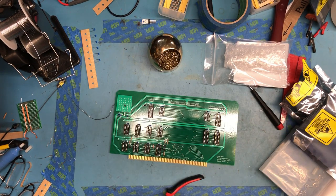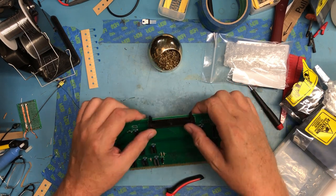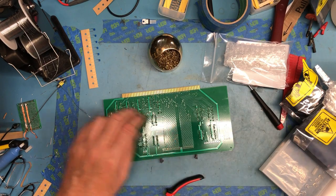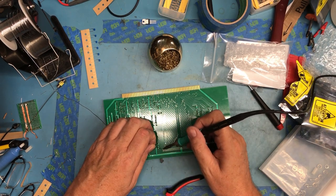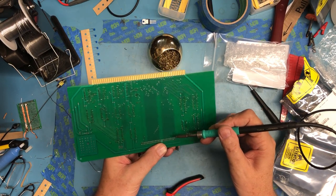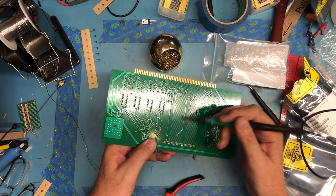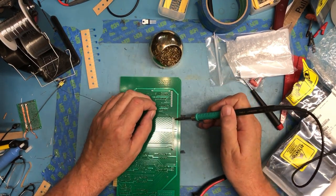Interesting that the part numbers for the two 50-pin connectors were different. They're both right angle, so this calls for a, where's the part number in here, 5302AR53. Yep, that matches his BOM. Looks like in this case it goes on the front of the board. Tack a couple corners, make sure it's flush, and then walk through it. I think part of the part number difference has got to do with where the alignment slot is for the ribbon cable header. Now, this is a pretty quick, straightforward build.